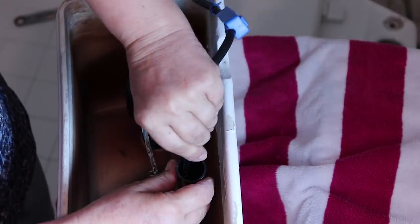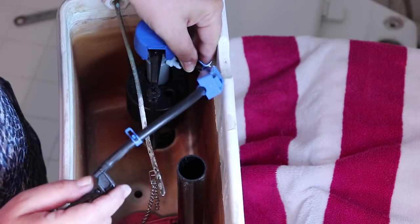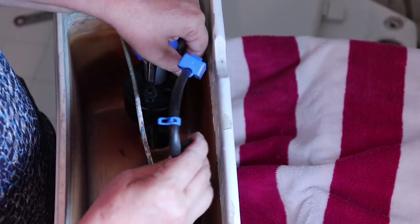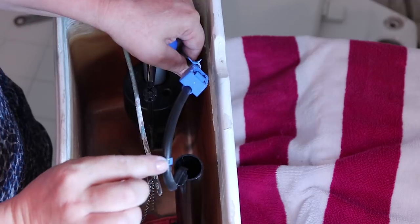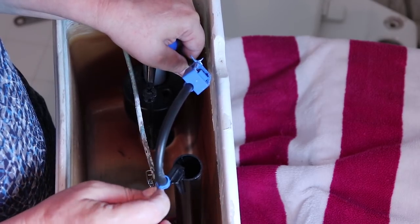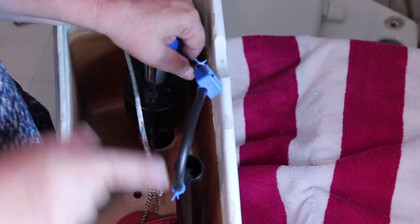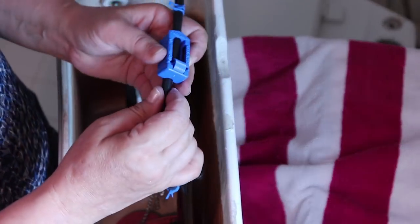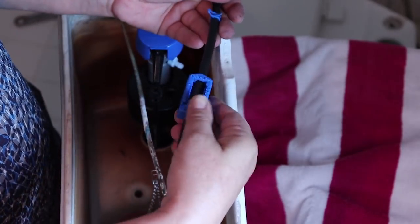We're ready to install the water supply tube. They give you this tube that's going to be the water supply - you put it right here on the water entry. You put it on and then put the clip right here on the overflow. They also give you little mini clamps that you slide down to close off the tube. The problem is this part is too high, so when I put the top on it bends it, so the only thing I can do is cut the tube.